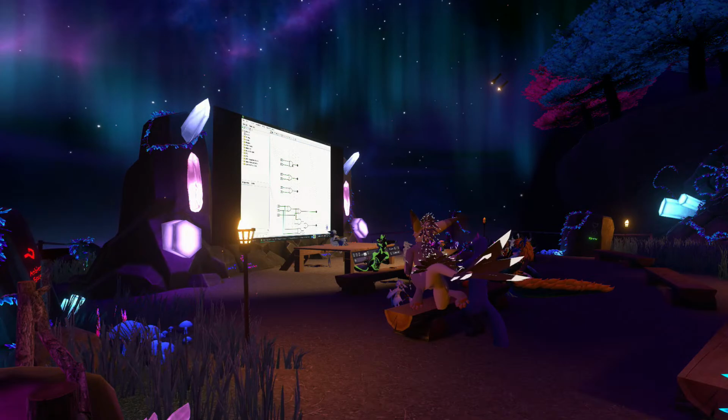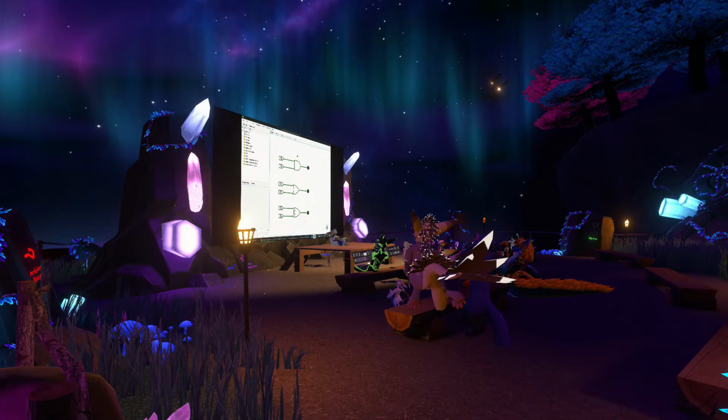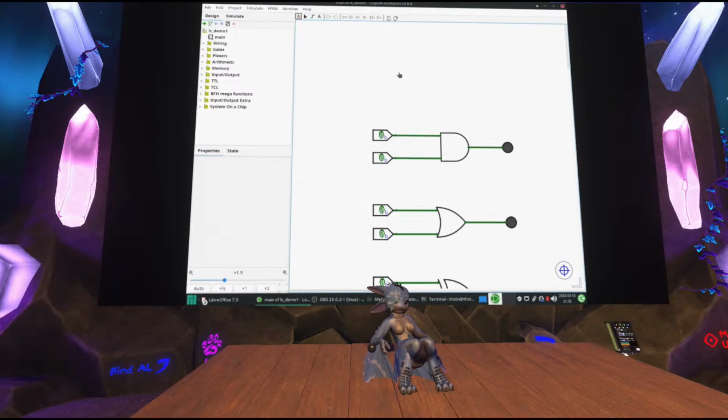So once again, we're continuing to roll with the definition from earlier, that we're considering ones to be a positive voltage and zeros to be ground. While I'm going to play with this at a more abstract level, just punching in ones and zeros, just be aware that we are still connecting this to an actual physical implementation using voltages, so these abstract symbols are 0 and 1. So these are some common logic gates which implement very simple functions on binary bits of data.